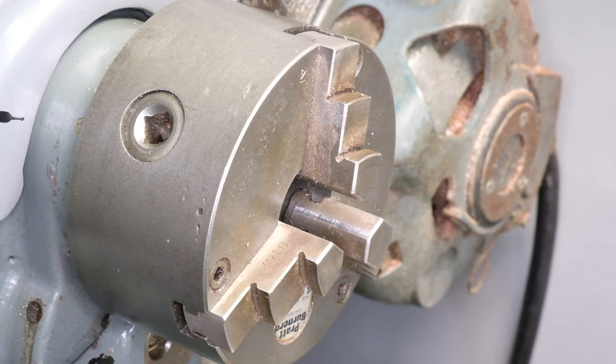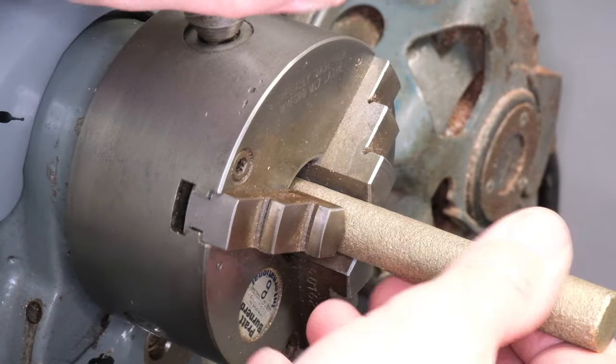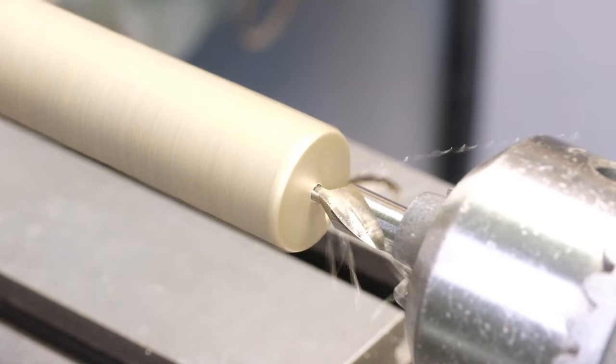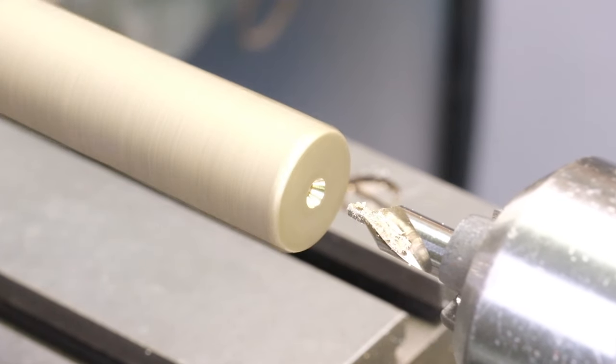With our movement frame jig completed, I decide, for some light relief, to make a replacement movement frame washer to replace the one that's missing. I use cast brass for colour matching and then tone or patinate the finished item to make it match with the rest of the frame.